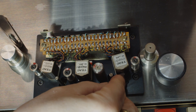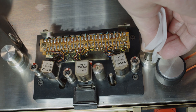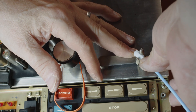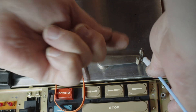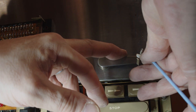Each gap on a multi-track head — or any tape head for that matter — is less than the width of a human hair divided by 50. It doesn't take much contamination to block that signal, and when it does, you lose clarity, you lose level, and sometimes an entire track. Contamination effects playback the worst, and when it's bad enough, the recording suffers too. When you're cleaning, use high-percentage isopropyl alcohol — at 6R we use reagent alcohol, it's a better solvent with the least residue. Wipe the gap vertically, perpendicular to the tape motion, and never use anything abrasive unless you're intentionally polishing. When the swab comes away spotless three times in a row, you're there.